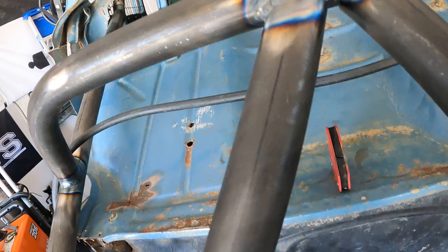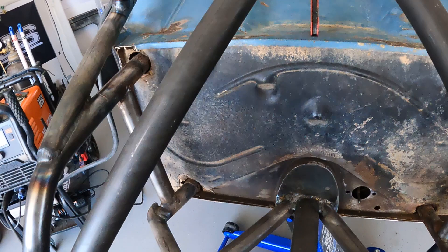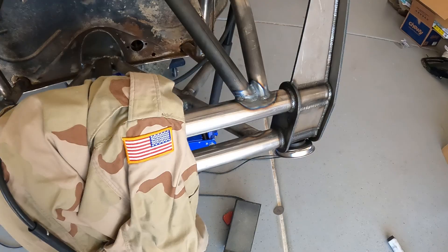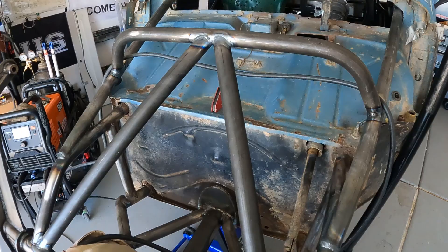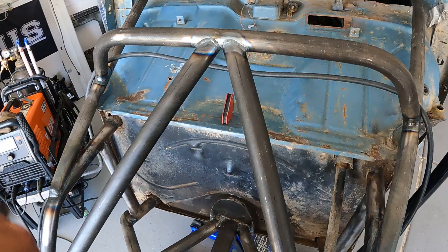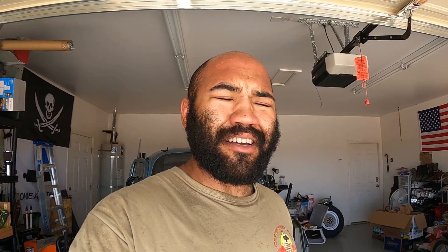Something I keep failing to realize — this is the third time it's happened — I forgot to drill a relief hole to relieve the pressure. I was going around stacking nice welds and then it popped right in my face, blew a piece of slag back into my torch, and popped the breaker. Make sure you guys drill a hole in your stuff if you're welding it sealed up. This tube is still open on one end so I'll just drill a small relief hole somewhere in there, and when I'm done I'll tack over it. I am sweating. Got it all welded all the way around — hard as hell but quite doable.